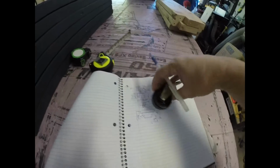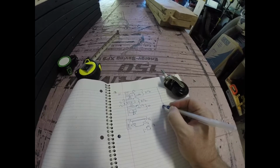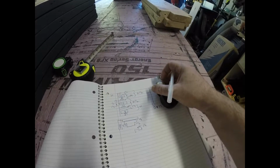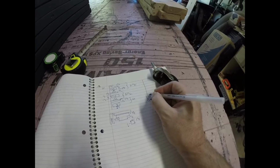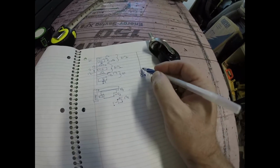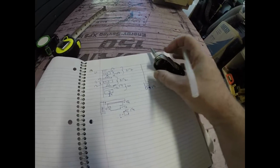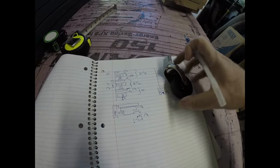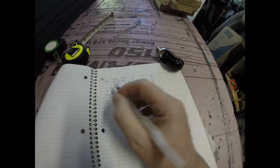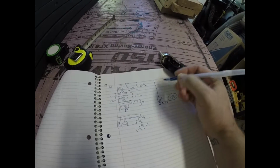Now I am putting these casters on the legs. So one thing, I'm using 1x4s. So these are 1x4s here. And that's not enough to screw this into. So I am going to put another block of wood next to there. And again, I've got pretty much that much space to deal with, 15 inches to deal with. So I don't need to be that tall. I just need a block of wood here that I can drill between and screw on the legs. So this part of the wheel will be the bottom. And this is 2.5 inches. So 60 minus the 2.5 inches gives me my 57.5 inch that I will need to cut my legs at.